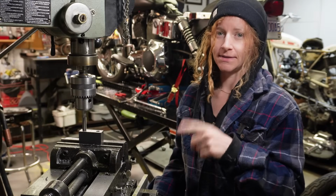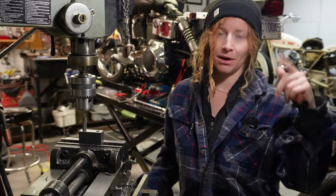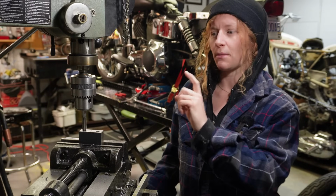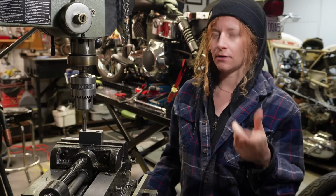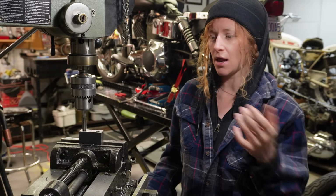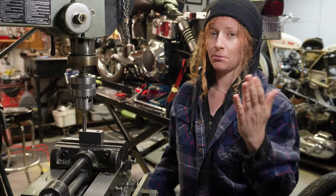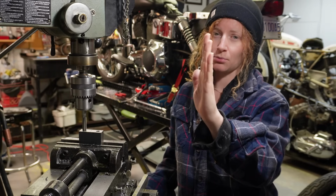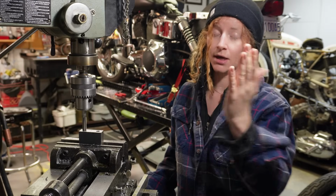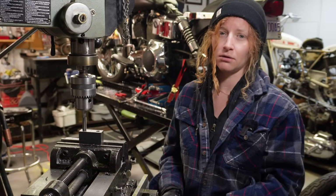And I'm just getting ready to tap these holes now. I have my tap set up in my drill press, and I've got my belt undone in the drill press, so it's not actually hooked up to the motor right now because I'm going to turn this in by hand. And I've shown this before in other videos, but new people on my channel might not know this yet. I like to start my taps on the drill press just because that helps them to go into the hole straight, so you don't end up with your thread going kind of crooked, or your tap starting crooked. So if I start my threads on the drill press, it makes it a whole lot easier.